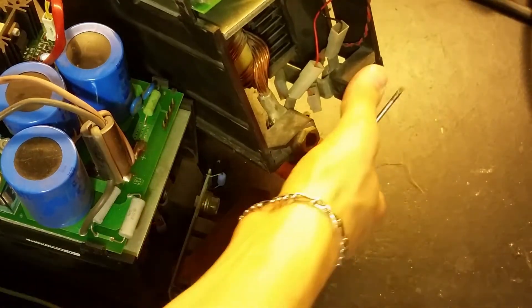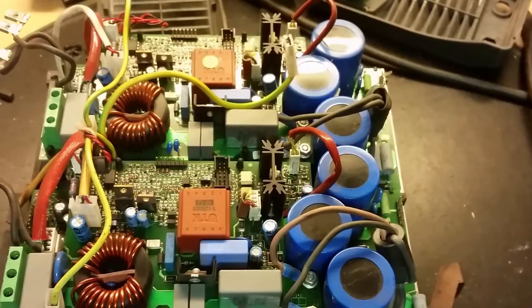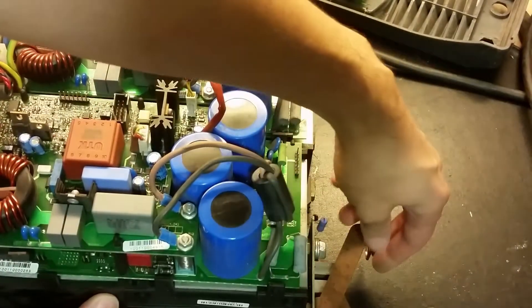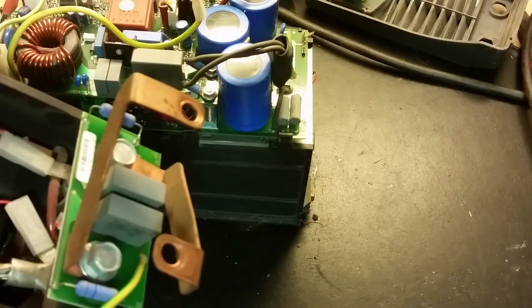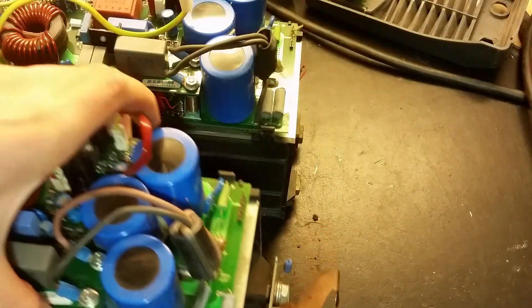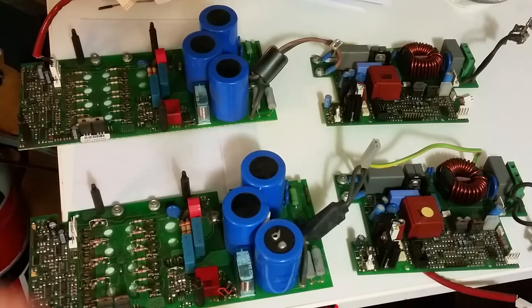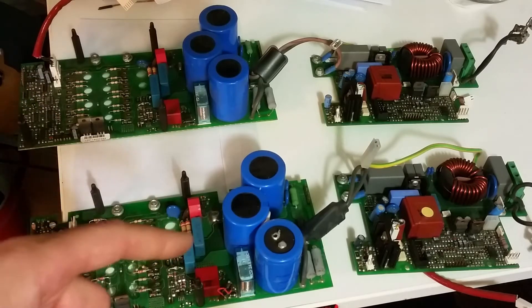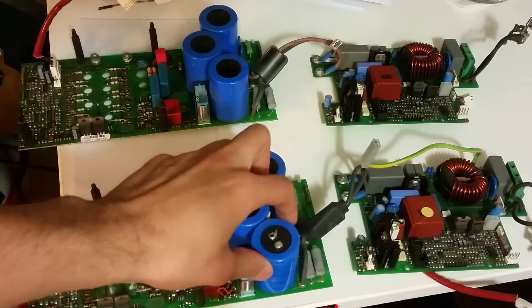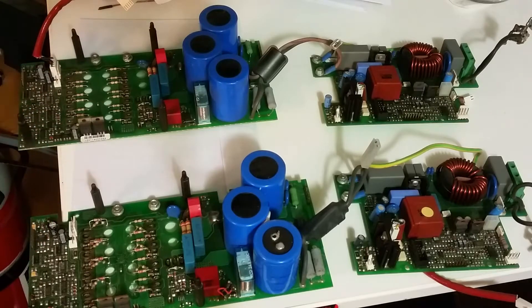They are not quite the same - on the front, this one looks a bit longer. The circuit boards look quite similar but the lengths are not the same. The terminals are in here - it's the same module but the front part is a bit different. Now I remove the circuit boards with the IGBTs soldered, which were stuck on the heat sink. This is the welder I will repair - the capacitor well fell off of that. I'll put the other circuit board in the welder and see if it works better.